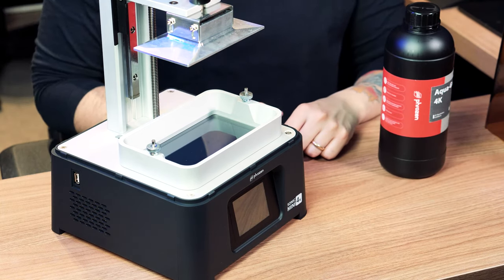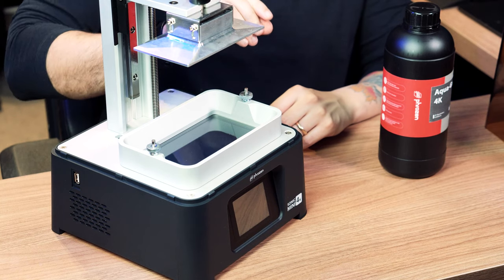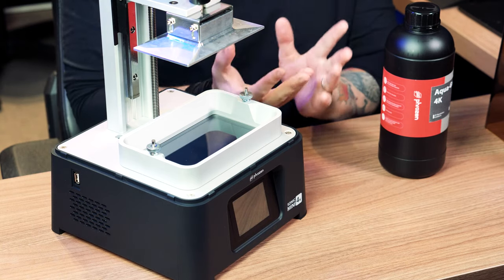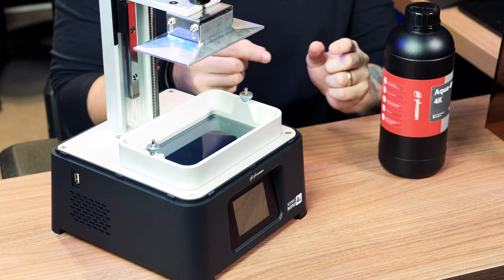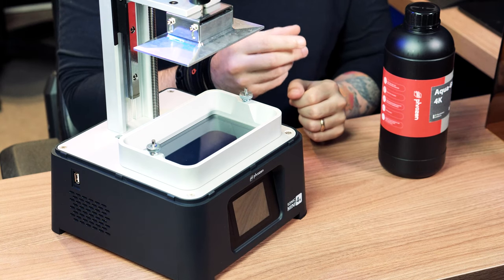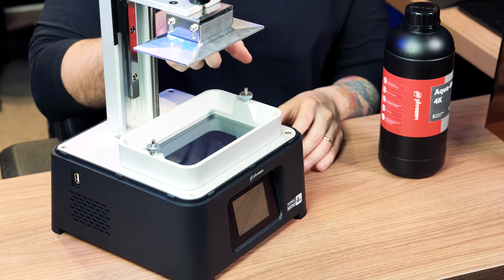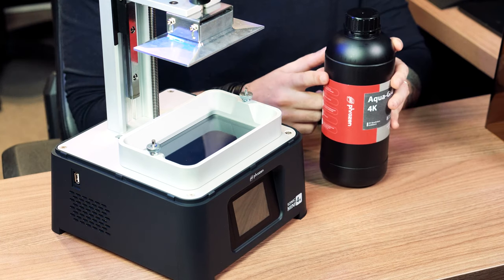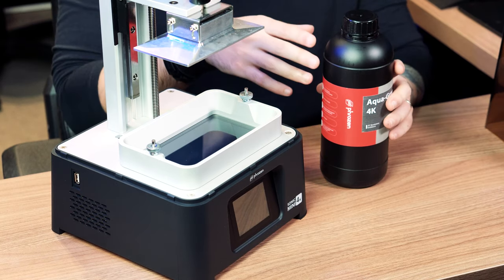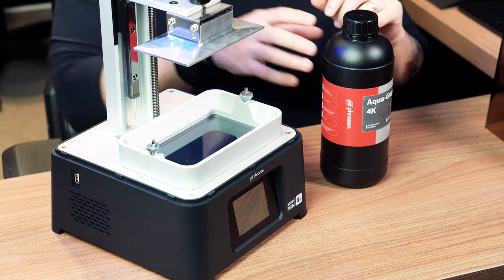While printing, there will be a small pool of resin. The build plate will go down until it almost touches the FEP, leaving just a small gap. Then the UV lamps will turn on, the LCD will project an image, and in this gap the resin will be cured in a specific shape, forming the layer. After a few seconds, the build plate will move up and then down again — a little higher — forming a new gap, curing a new layer, and so on. After multiple layers, the 3D object will be created. As the resin cures with UV light, we can't leave the bottle or the printer open for a long time because the resin will start curing with sunlight. So during this process, make sure the cover is on the printer.